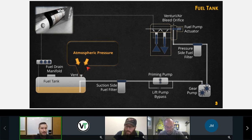I have seen, at a Cummins shop, I might add, a diagnostic for a low rail pressure fault which resulted in the changing of this high pressure pump, the entire assembly. We're talking thousands of dollars, and it was in fact a plugged tank vent that was the source of the low pressure fault. I've seen that, and probably it's happened a billion other times. The guy saw a low rail pressure fault code. He said, "Yeah, I've seen these pumps fail before." Threw a pump at it, and all the while he just had to clean the tank vent off. It's unfortunate, but if you cover your basics first, then you will avoid replacing a pump that does not need to be replaced.